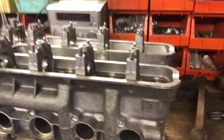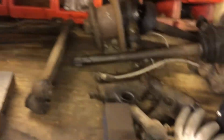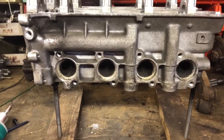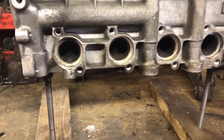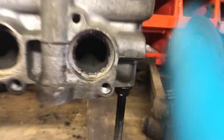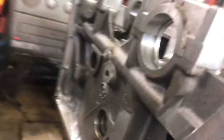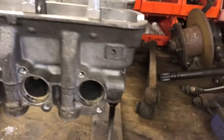...Mini head, the 16-valve BMW K head. I've got a load of other bits and stuff I need to clean up on the bench. I'm getting this ready to go off and be gas-flowed, but I thought it would be good courtesy to just get inside the exhaust ports and clean out the junk, as there's still aluminium swarf falling out from inside where it's been machined.